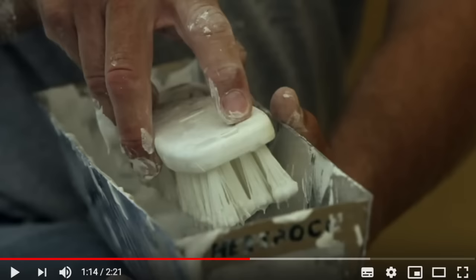One thing to consider is I would look for a better brush. Here's a picture of the brush from the USG video that I poached this method from, and you can see it's got long stiff bristles spread apart. If you don't have something like that handy and you're having to go out and buy one just for this, at that point you may as well buy a can of spray texture. However, if you're in a pinch and you need to get some texture on a wall quick, it's good to have as many methods as possible in your mental toolbox — so here's one more for the books. Thanks for watching Vancouver Carpenter.